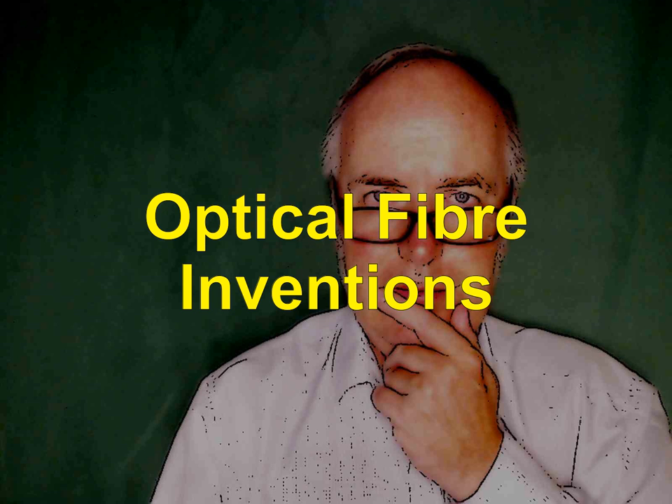Let's firstly look at what an optical fibre is. An optical fibre is a 125 micron diameter glass tube. You start with a possibly four-centimetre-wide optical fibre preform and it's pulled down like toffee to this very fine tube. The glass is heated up so it's just soft enough and pulled to a really fine diameter. In the centre of this glass tube, by different processes, you can place metals to create a higher refractive index, and this higher refractive index acts as a very long extended guided lens — really an optical fibre is a 10 to 60 kilometre long guided lens.